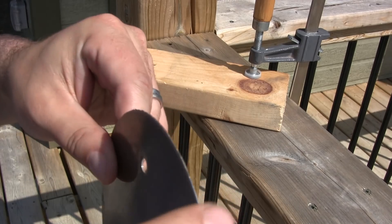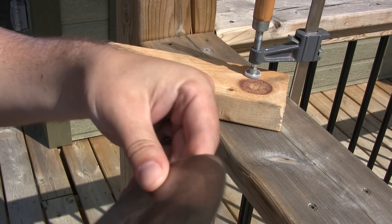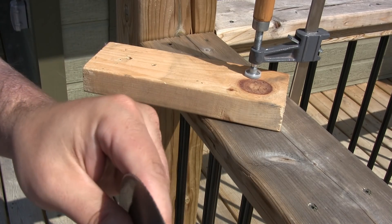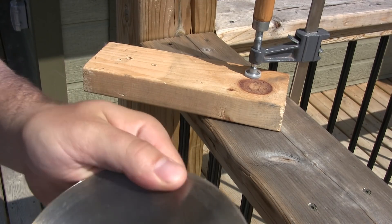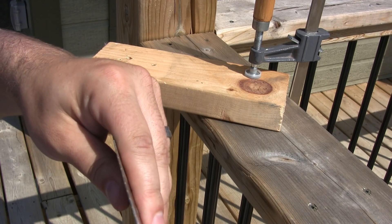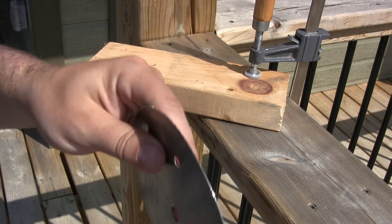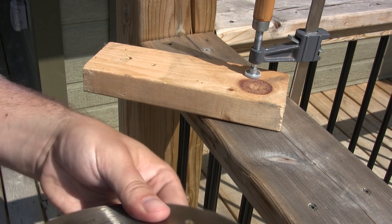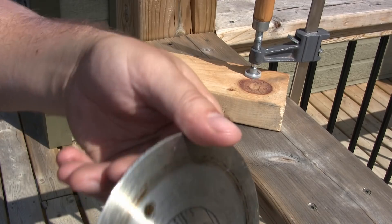So we've got the blade done. It's not the sharpest in the world, but it doesn't matter because we're going to be using mostly friction. The sharp-ish edge is going to be nice for slicing the plastic sheathing that goes on top of the foam, but it's not going to do much otherwise. Really what we want is no kerf, which I've got here now. The kerf being the width of the deviation of the teeth including the blade — mostly it's the teeth that allow clearing of pieces of wood and the shavings. So let's see how this works.